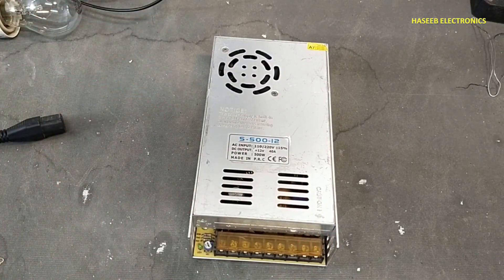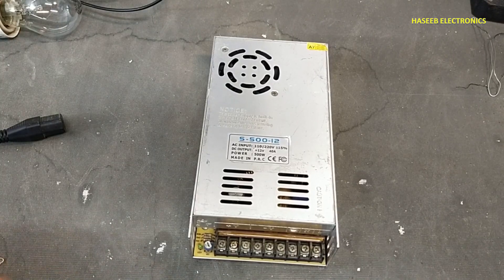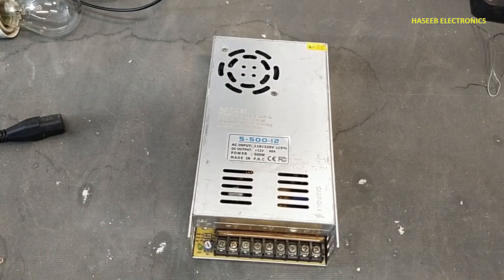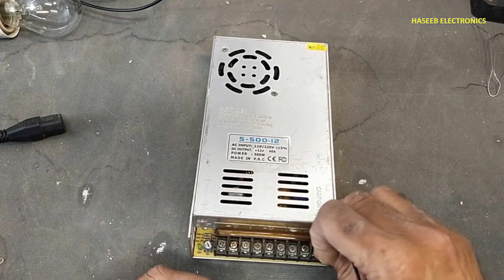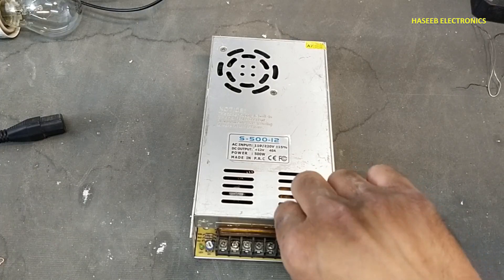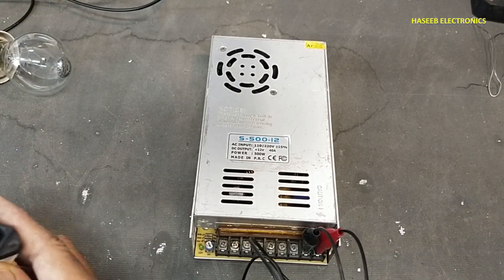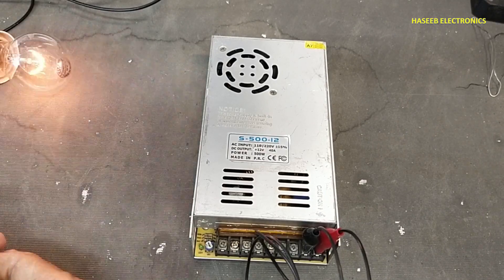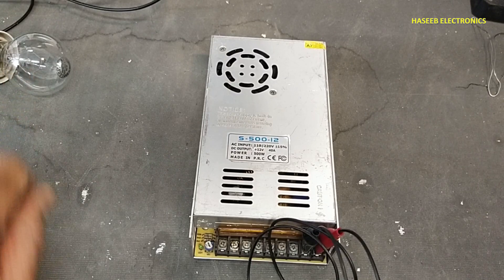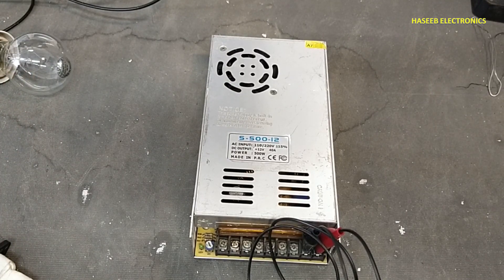Because it has an isolated live electrical voltage in this power supply. The rightmost pin is line, then neutral. I will apply power using a series lamp and we will check the condition of the series lamp when we apply power. If it draws power, that means the input circuit is working.